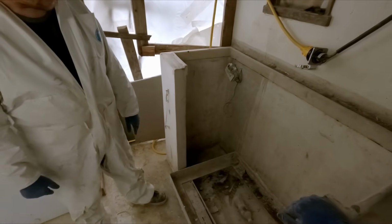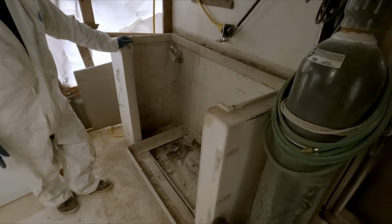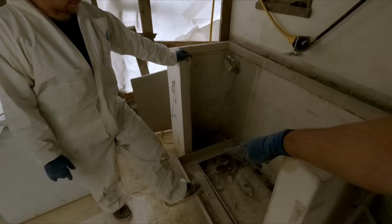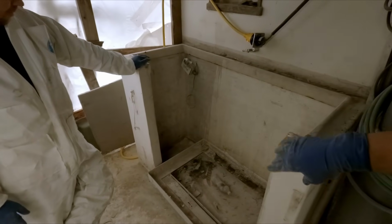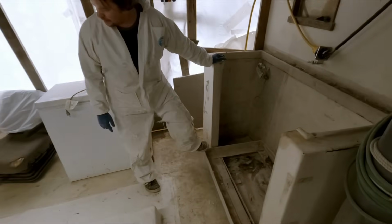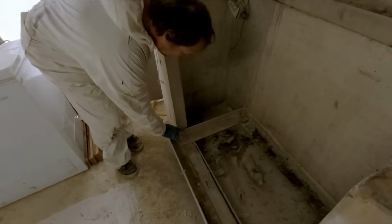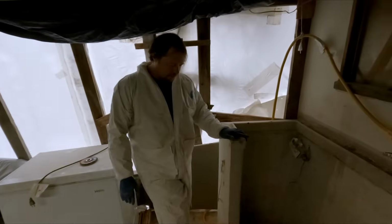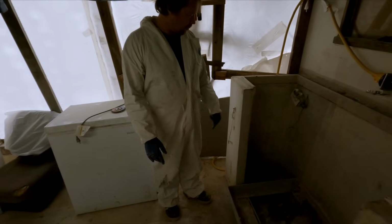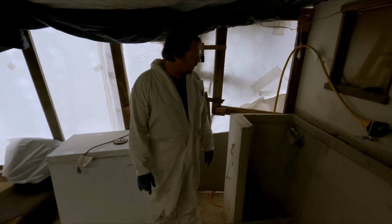So this is deck space that is not very well utilized, so our plan is just to tear this thing out. We are going to keep a freezer on board because it's pretty nice having those. We'll retrofit this frame and get it scooted against the wall and strap it in some way or fashion. Cut it down to fit this freezer, because right now the freezer only comes to like right here, so there's just this space. So we'll trim that down, re-weld it, probably put a couple of legs off the front right here, keep that up off the deck so it's not getting a bunch of water splashed up on the bottom of it. And that'll do it.